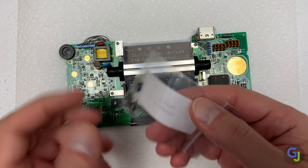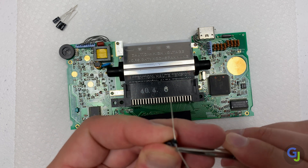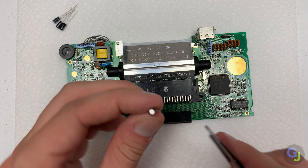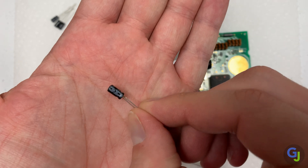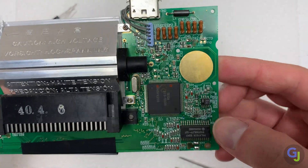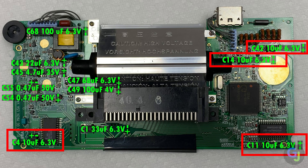Let's discuss capacitors for a second. Through-hole parts are not meant for surface mounted boards, so they require a little modification to work. I like to bend the outer legs out and back in at an angle so that they are at the right width for the install on the boards. Polarity matters for these installs too, which means you can put these in backwards. The side of the caps will have a mark down it — on these it's either gray or gold — showing you the location of the negative terminal leg. The shorter leg is the negative and the longer leg is the positive. Sega must have made these circuit boards with future replacements in mind, since the positive or plus symbol is actually printed on the board for each cap location. They also have labels like C42, which you can reference on the console5 page included in the description. The red highlighted parts are what we will be installing next.